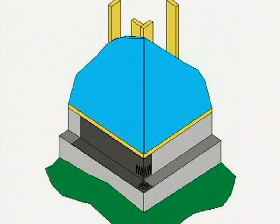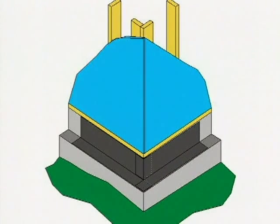A little mastic should be applied — something to bind the two together — unless you're using a peel-and-stick that already has a sticky back on it. The next piece is installed in the same fashion and wraps around from right to left, as you see here. Notice how the corner is completely lapped in flashing.